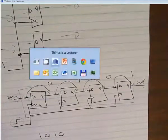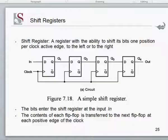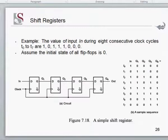And that's indicated in a bit of a clearer way here. If you consider this, this is that same serial register, and at different times, we present a certain 1 or a 0, some signal we present here at in, and then this table here tells you what happens with that. So first of all, let's pretend that they were all cleared. We don't really know. That should really be x, x, x, x, x. We don't know what the value of q1, q2, q3, q4 are, unless we've reset them. But we don't even have a reset function here.